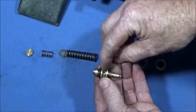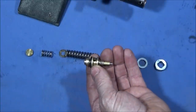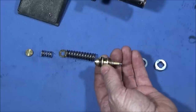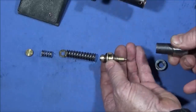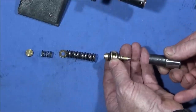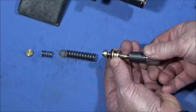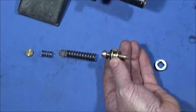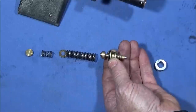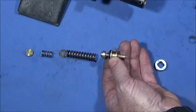This groove part here with the four holes sits directly over the transfer port from the main reservoir to the barrel. The transfer port is the inlet port to the barrel. When you pull back the bolt of the gun, it pulls this hammer back under spring pressure onto the sear of the trigger. When you pull the trigger, this one flies forward under spring pressure, hits the striker on the back of the valve, and pushes the valve open. The air rushes into that larger diameter bore and out through those exit holes on the groove part, through the transfer port on the inlet of the barrel, and that's what fires the pellet down the barrel.